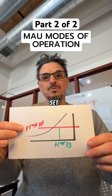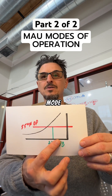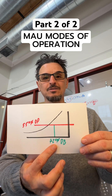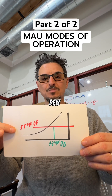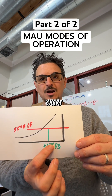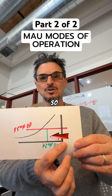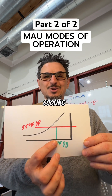If you're below the dew point set point, you will be either in heating or cooling mode. If our dry bulb set point is 72 degrees for your supply air, you're below 55 degree dew point, and you are in this region of the psychrometric chart which is hotter than 72 degrees, we'll be in the cooling mode. You'll basically cool that air down to the set point using DX cooling or chill water.